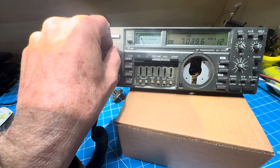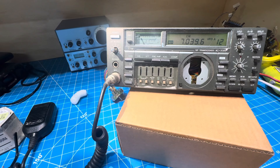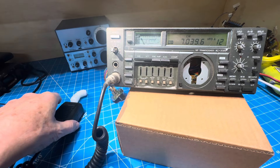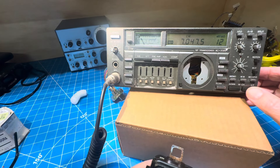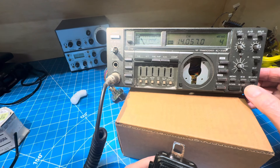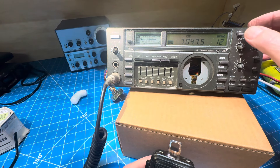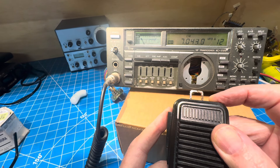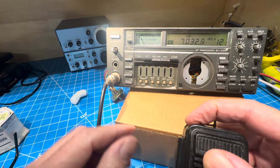Let's see what antenna I'm on and what band I'm on. There we go — so that's the 40-meter dipole. And we can already hear our favorite K station, so I think that's working. Now I think I can go to memory mode and we can change bands. And I think that's good enough for me. So now we're going to go back to VFO mode and I think I can creep up and down with the buttons. Not hearing many stations, but I'd say this is a success.